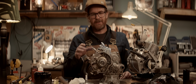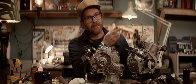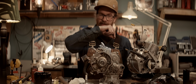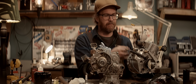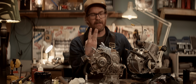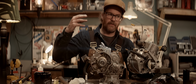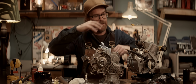I forgot what I was actually going to say before talking about this. Maybe that black stuff we've been seeing throughout the engine is actually combustion residue because of this 90 degrees of possible short circuiting. Maybe the exhaust is pushing exhaust gases through the transfers down into the crankcase at around top dead center. And maybe that's why we're seeing this black stuff in the rotary valve assembly and in the crankcase. That would explain a lot about no power production, because maybe there's much higher pressure coming from the exhaust port at top dead center, and it's filling the crankcase, diluting the fresh mixture with exhaust gas.